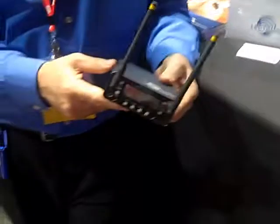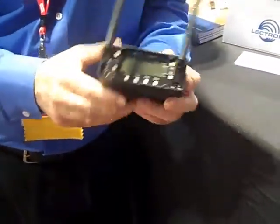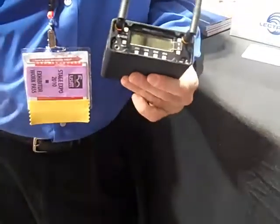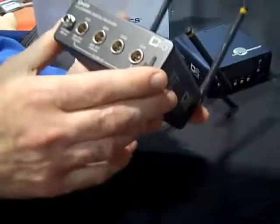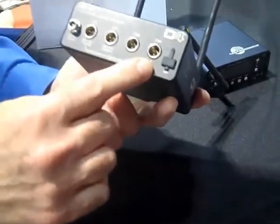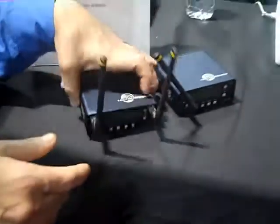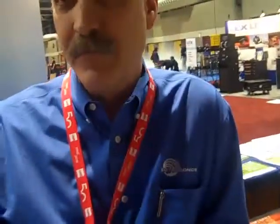We have a new fully digital product called the D4 system. This is a fully digital RF carrier carrying four discrete channels of audio in a digital domain. It has four inputs on the back — either four discrete inputs or two stereo AES pairs. It's a very powerful system with 250 milliwatt transmitter power, so it'll cover a very large venue or outdoors over a very long distance.